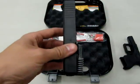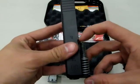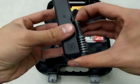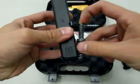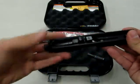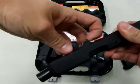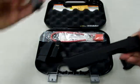For the slide assembly, you need to remove the recoil spring assembly. This back plate here is held in place by that little ledge right there. So go ahead and depress the spring a little bit. It'll rotate out, and you can go ahead and remove the entire recoil spring guide. Last thing to do is just take the barrel out. The barrel is a typical camming action, so go ahead and push the barrel forward a little bit, and then you'll be able to rotate it straight out.